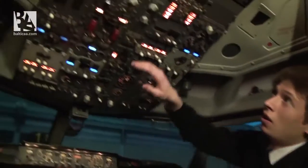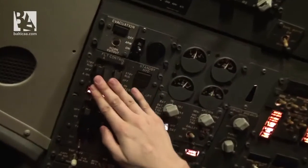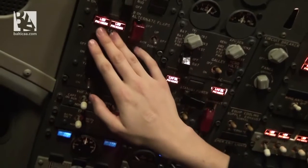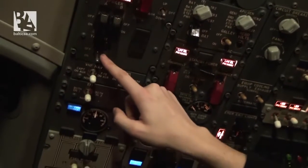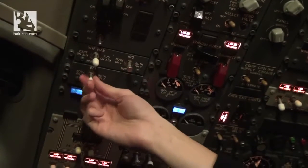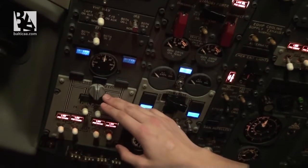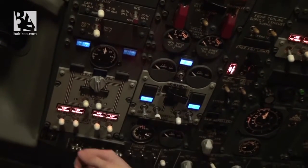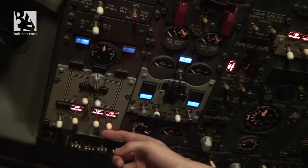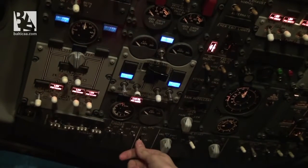With the IRS aligned, we start the overhead scan. We check evacuation on armed, that we have flight control spoilers and alternate flaps guarded. The yaw damper is on, all instrument transfer switches are to normal. Fuel valves are closed, cross-feed closed, and we select the left aft pump for APU operation.